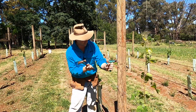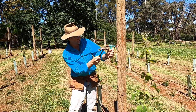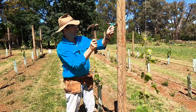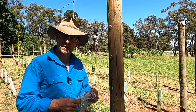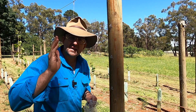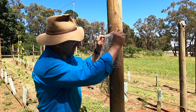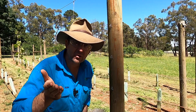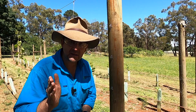Even just using the hand tool with a hammer, these clips were incredibly easy to apply and very fast. There is also another unsung story with the tuck-away staple: if you use nets on your canopy, using nets on plastic clips leads to them getting tangled, stuck and ripping. If you rub a net past the tuck-away staple there are no sharp edges, nothing to catch on — it just comes straight off. Perfect if you're going to be netting your vineyard or orchard.